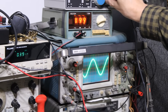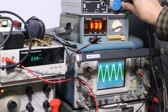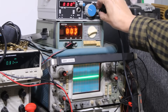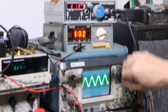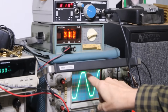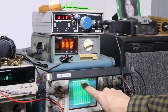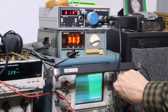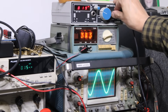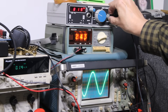It's alive — really symmetrical, not very much crossover distortion. Let's take it on into clipping. Now I'm running this at 8 ohms on the 8-ohm tap since I have all four tubes in there. Notice the clip is very clean — there's not very much ripple. If you zoom in, you can see some ripple on top of it, but that's 60 Hz from the power supply. I don't mind running one of these at full power because I know the transformers and power supply can handle it, but since it's a prototype I'm going to take it a little easy on it.